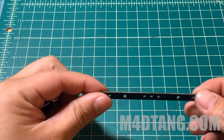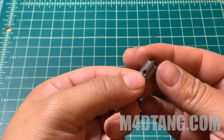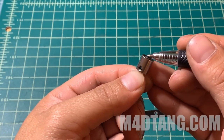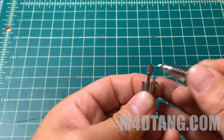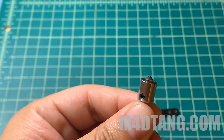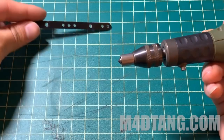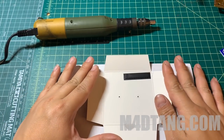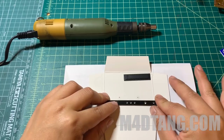Now I'm going to do a quick test to show you how it works. I'm going to use a 1.5mm FRP plate as an example. When setting up the distance of the countersink bit, first make sure the conical tips need to be 100% standing out. The part you need to adjust is the cylinder body of the countersink bit. I'm going to stand out about 0.5mm of cylinder body, then go ahead and lock it. Before you make a countersink hole on the FRP plate, make sure to set some scrap paper on the bottom, especially when you are going to work on 1.5mm FRP or carbon plate.